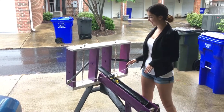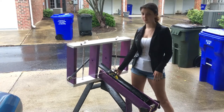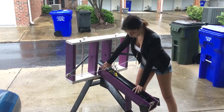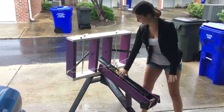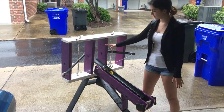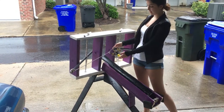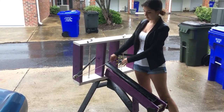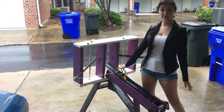The second main part of the catapult is going to be the pathway in which the tennis ball travels. We have the wood set at a 20-degree angle, and we lined it with a PVC pipe so that it's easy for the tennis ball to travel. The object we have to hold the tennis ball in place is going to be this light bulb screw insert, because after trial and error through cups and wood and all that stuff, this worked the best.